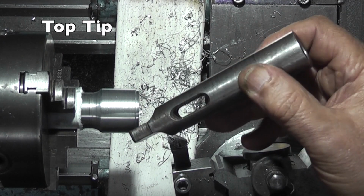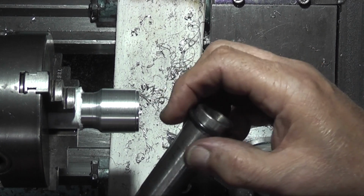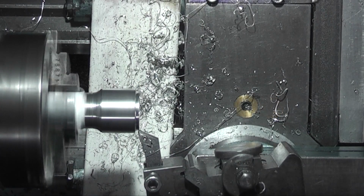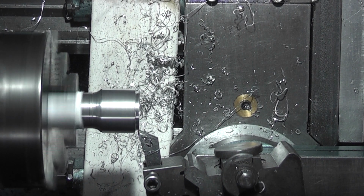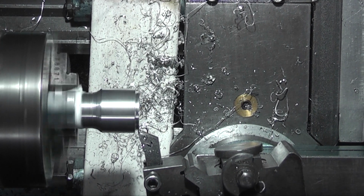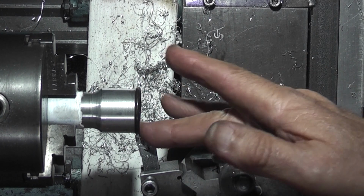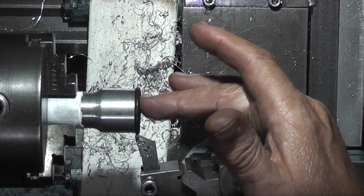Here's a tip: if you take a Morse taper sleeve and put the rubber O-ring onto it, you can find it's nearly on the end of that where it grips. So if I make it as big as this, this diameter is 25mm. That's okay. 2.6mm from the face. It's a 3mm diameter, so it's leaving just over under half a millimetre sticking out, which is ample.